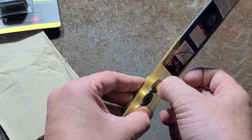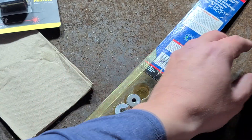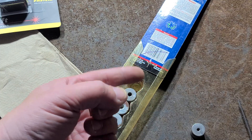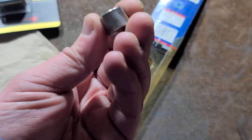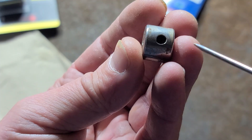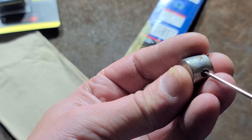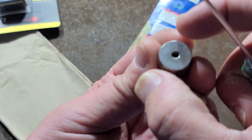They'd have ratchets and socket sets and also things like these drill stop collars, which appear to be nearly impossible to get out of the package. They come in both metric and fractional. A seven-piece set would be eighth inch, three sixteenths, quarter inch, five sixteenths, three eighths, seven sixteenths, and half inch — the most common sizes. These are definitely older because they have slot head set screws. More modern ones of this style will have hex set screws, and premium ones will be split.